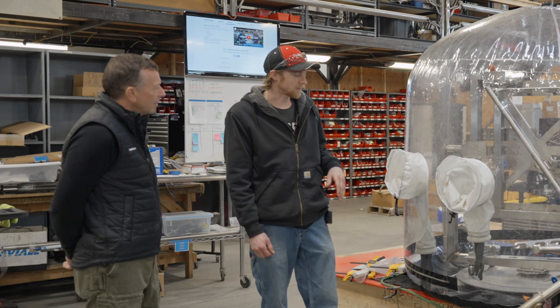Part of the thing we had to prove out in our titanium weld spec was the cleaning of titanium, to make sure that works. So you go through a ton of cleaning on this stuff as well. There are quite a few steps to the process of cleaning it. After it gets coped — we have machine copes — it gets deburred, and there are at least three different layers of cleaning. When you're all done, you have white cotton gloves on. No oils from your hands are allowed. And then it gets passed through the tube into the chamber, and then you're good to weld. So not an easy material to work with.